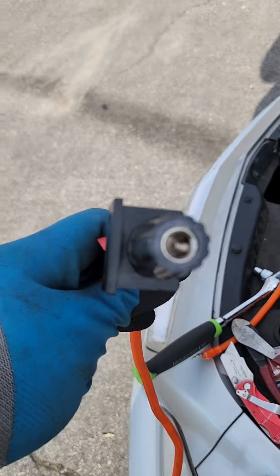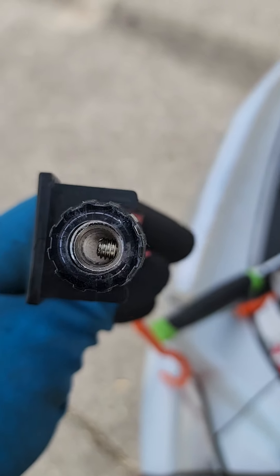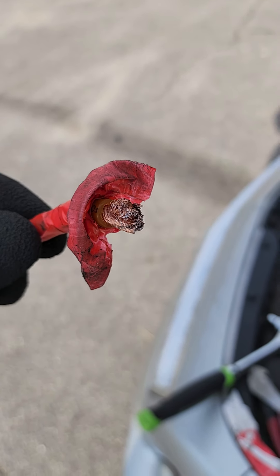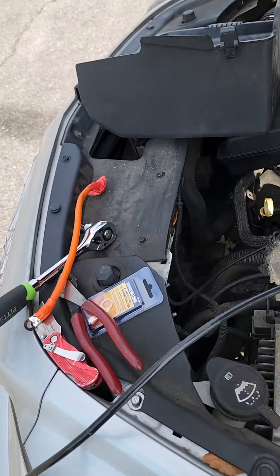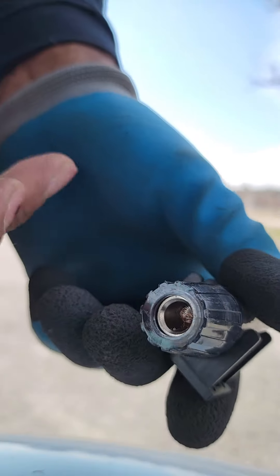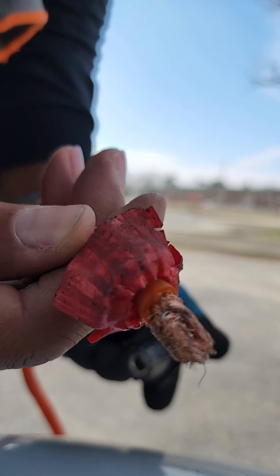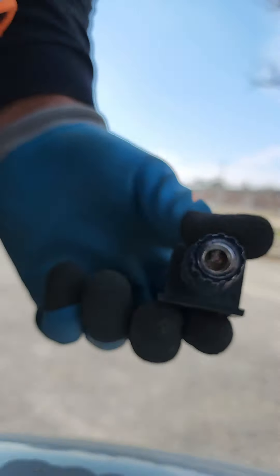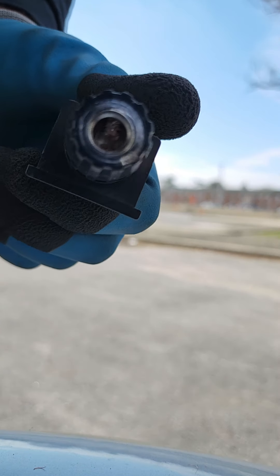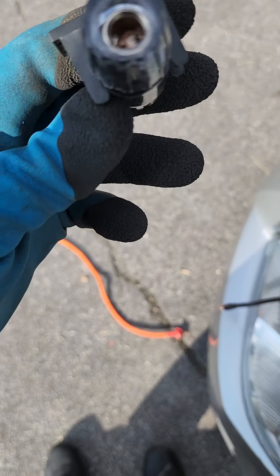I'm going to show you real quick: when I first disconnected the old CCA, it pulled right out of this screw and I had the screw tightened down. You see the strands — it just yanked right out of there without any effort. So I'm going to try it now with this piece. I'm pulling right now — I didn't unscrew anything and it came out. Like, you shouldn't be able to do that with the connection. It just ripped right out. I didn't unscrew anything. You see some of the copper still in there. You're supposed to loosen the set screw. I did none of that. That's another reason I'm changing it. Look at that — ripped right out of there. That's not good.